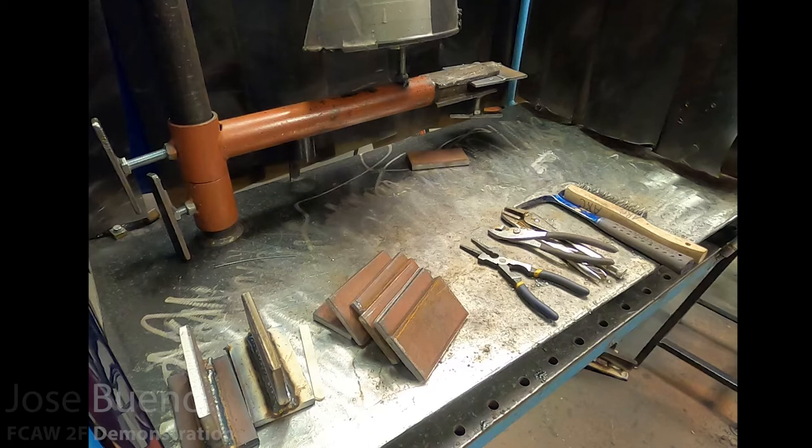You can think of welding with FCAW in a similar fashion as shielded metal arc welding — if there's slag, you typically use a backhand welding technique, or a drag angle. For right now, let's just focus on dragging the weld. So you're dragging the weld puddle across, just like with SMAW, and in some cases with GMAW you're dragging straight across. It's basically the same with flux core arc welding. With that said, I'm going to skip over surface welds and jump right into horizontal fillet welds.